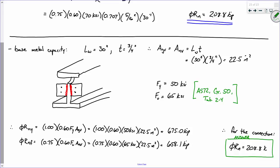Looking at whether yielding or fracture happens first — you might think since FY is smaller than FU, yielding happens first. But shear lag is accounting for the fact that not all of that area around the connection is effective in resisting the load because the stresses aren't uniform. It's not just the yield stresses — it's also the areas. Depending on the numbers and grade of steel, you could have fracture at that connection before yielding out in the main body. For welded connections, yielding first is more likely, but it's not always the case.